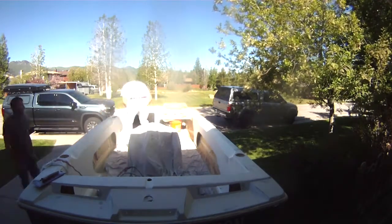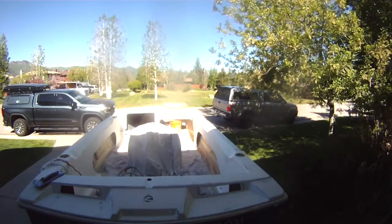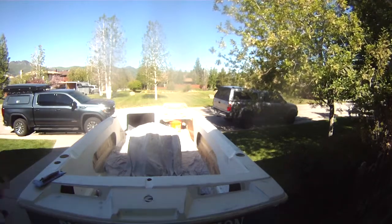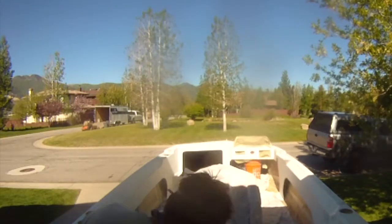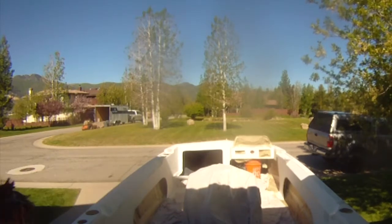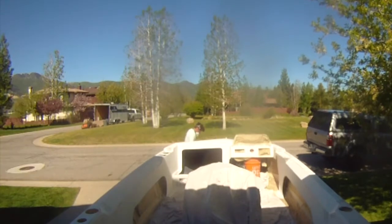Doesn't matter. I am putting 5200 in all the holes so that I don't have these holes that are leaking into the floor. Again, I don't know if that's a huge deal, but I want to do it because this is a boat that used to be full of all wet flotation foam, so I'm doing everything I can to seal this thing up so I have a nice dry boat, a light boat, a fast boat for the rest of the years that I'm using it.